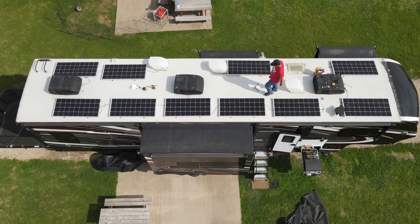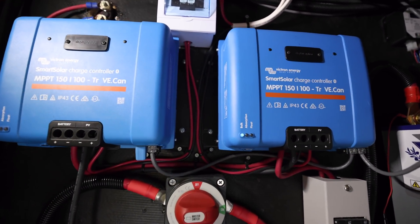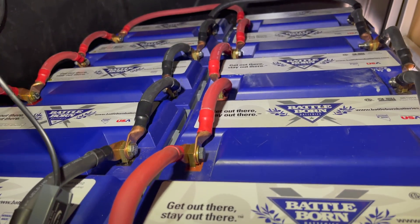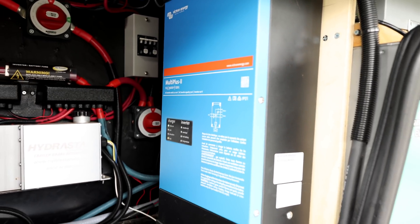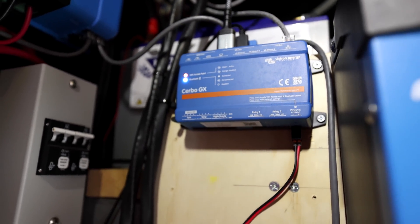So let's talk about where we are right now. We have 2,000 watts of solar on the roof — 10 solar panels at 200 watts each, separated into two runs in series. Those feed to MPPT Victron Smart Solar controllers that feed into our DC system, which is 12 volt. Also on that 12-volt bus are our batteries: 10 100-amp-hour batteries for 1,000 amp hours total, which is 12 kilowatt hours. We also have the Victron MultiPlus 2, 2×120, meaning it powers both sides of our 50-amp RV.